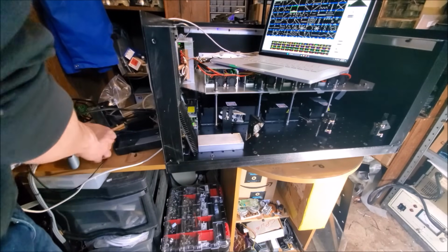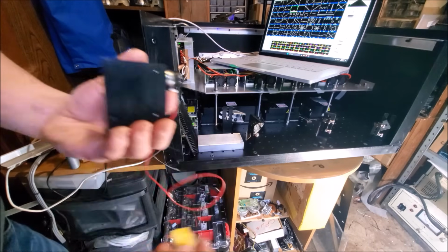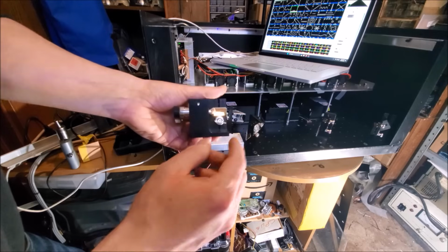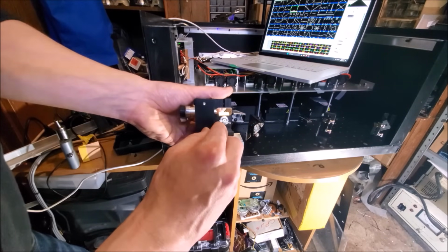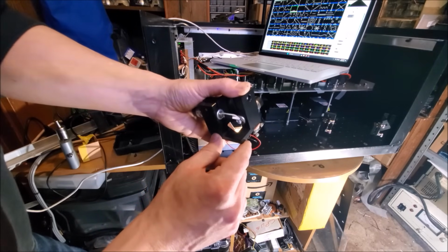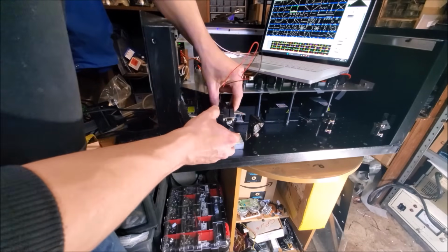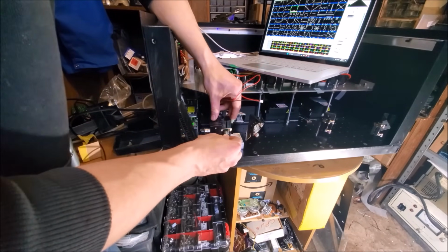So now, we got to figure out exactly where the galvos need to be positioned and see what the height is. The first mirror that the laser is going to hit is the X mirror, which steers the beam back and forth like this, which is this mirror right here. And they actually make that smaller, less mass on the mirror. They don't need to have it stick out that far. Also makes scanning a little wider, a little easier on the galvos. But anyway, so we're going to put that in there.